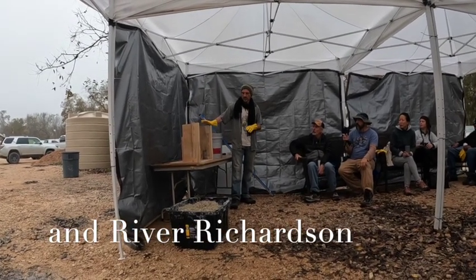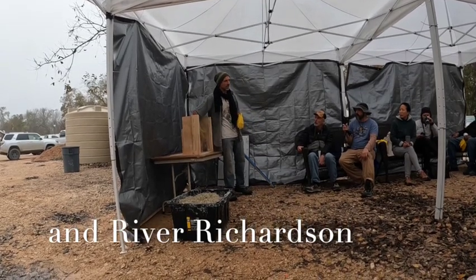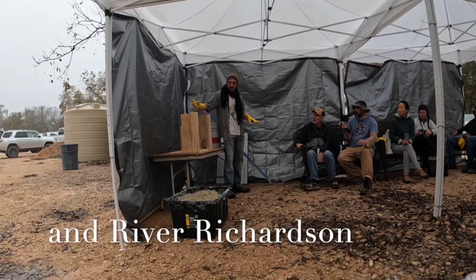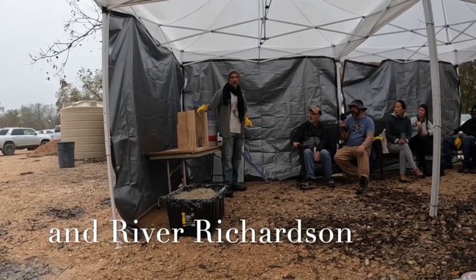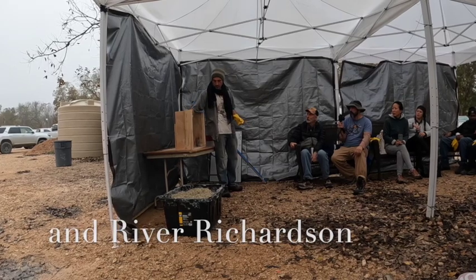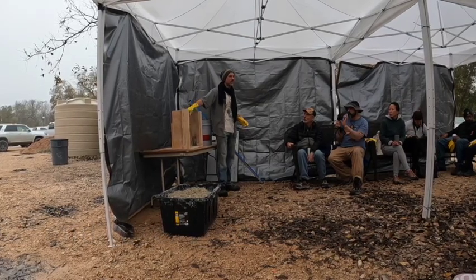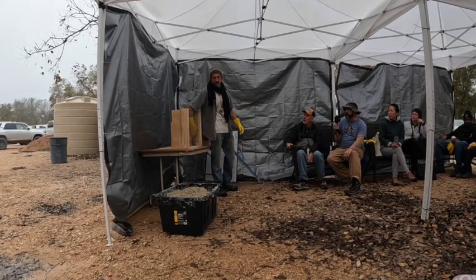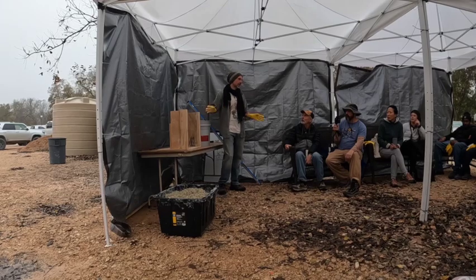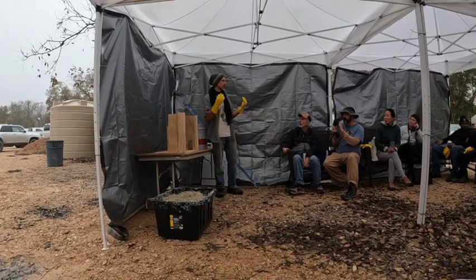One thing that we typically do, obviously we haven't got the nails in here with the discs, and we don't have any wood in here to represent the 2x4s. What we normally do is we paint the lime onto the wood before we put the hempcrete in there. This is really just an exercise to show you the tamping, so don't think about it as anything other than that.